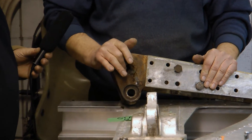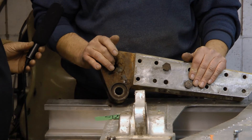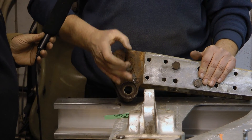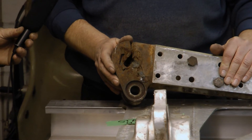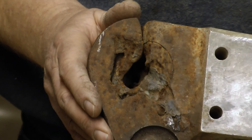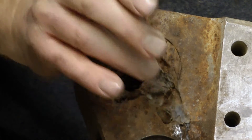Next, he's going to try and press out what's left of these locating pins. Then we can actually reconstruct these by re-welding — making the hole larger and putting in an interference fit collar — and then re-machine or ream, whichever way is easiest, to put the pins back together.